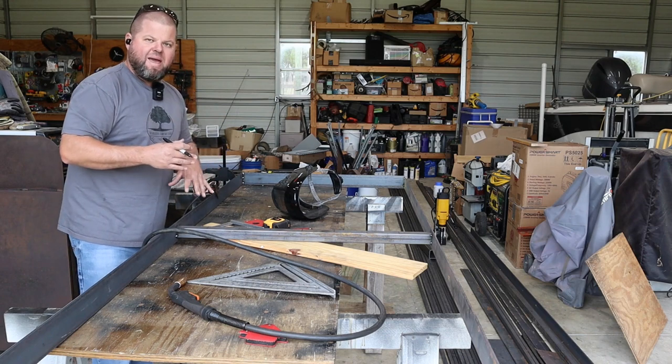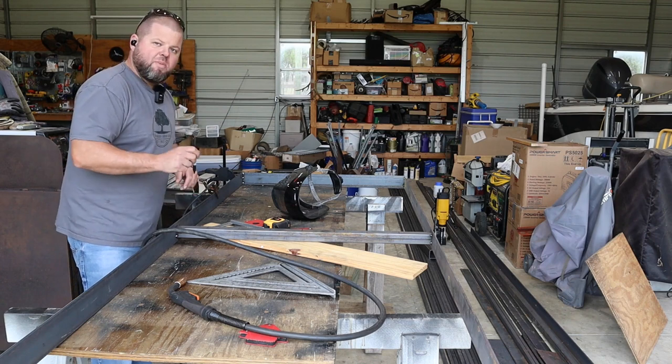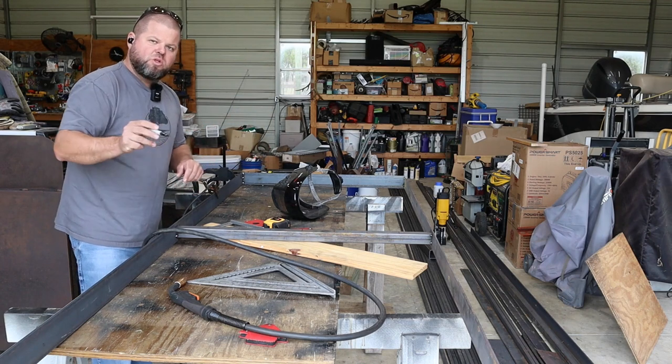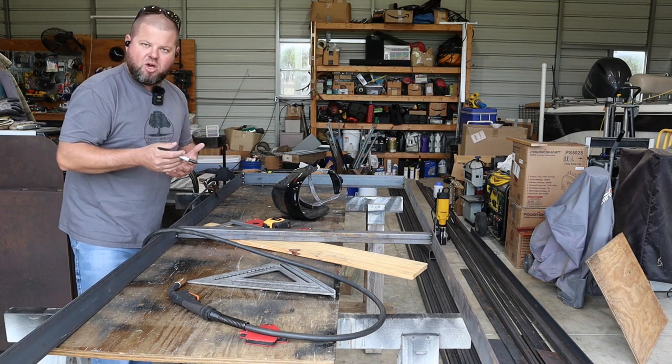So I had to do some quick math. I'm using 3/4-inch square tubing, had to take that into consideration, and I have determined that I have to do 7 different horizontal railings in the space that I'm working with here in order to qualify for that code rule.